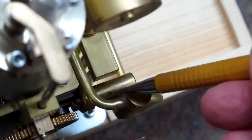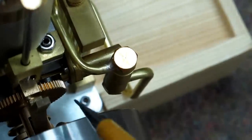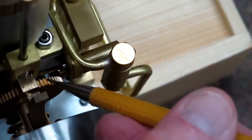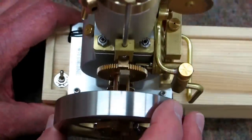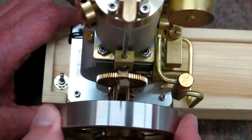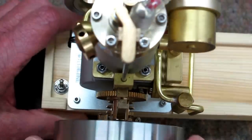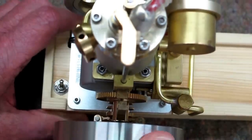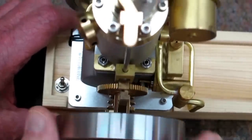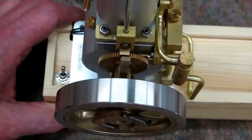The water pump is this section right here. There is a roller bearing on the end of the plunger and it runs on a cam behind this gear. As the engine comes up on compression, the cam works that plunger and then shortly thereafter opens the exhaust valve. So the cam is doing double duty on this engine.